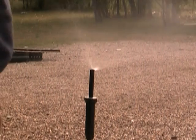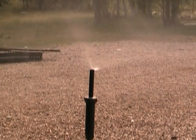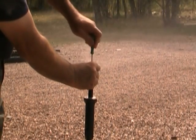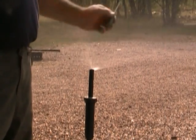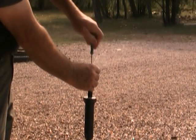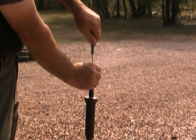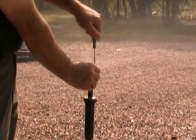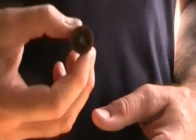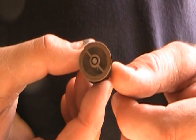You can use a towel. Water is coming out this way and this way. Now the set screw in the middle — I can turn it down. Now I don't have as much water coming out and it's not throwing the water as far. And I can turn it all the way out. Now I'll go with a 12 Van nozzle, which means I can control where the water comes out — quarter, a third, half, or full circle.